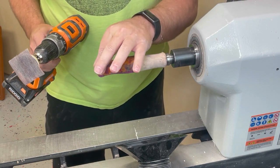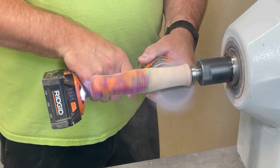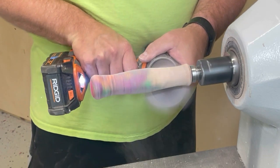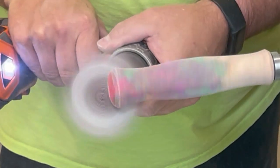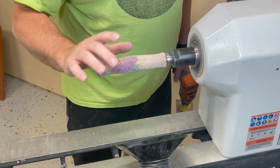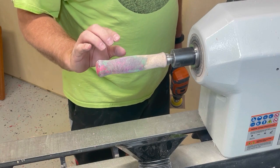A little trick you can use — and I've been made fun of for this before online, but I'll finish it off with sandpaper. There's some ridges on here, and it doesn't matter. Let somebody make fun of you — it doesn't matter. I'll use a drill with 120 grit, do that with the drill, then go back to hand sanding. This is a great way to get it nice and flat. These lines will disappear and then you'll know you're flat. So just use the drill, but don't do it on all the grits. Whatever you've got to do at the end, as long as it's a cool project — don't be intimidated into not doing what you have to do to get the job done.